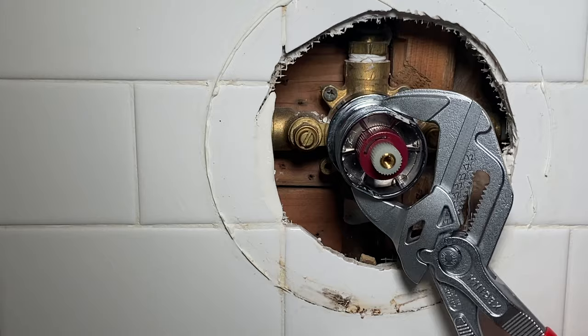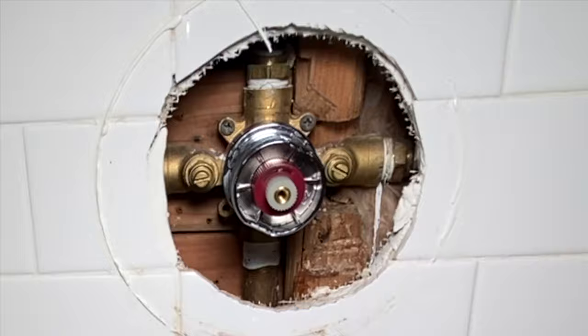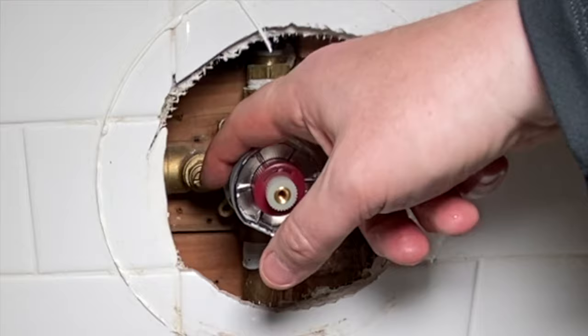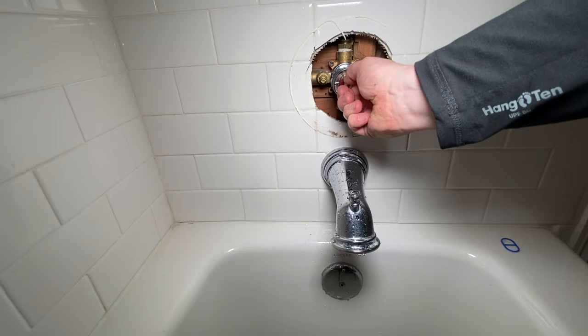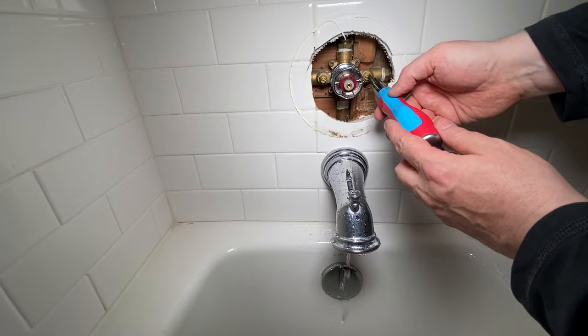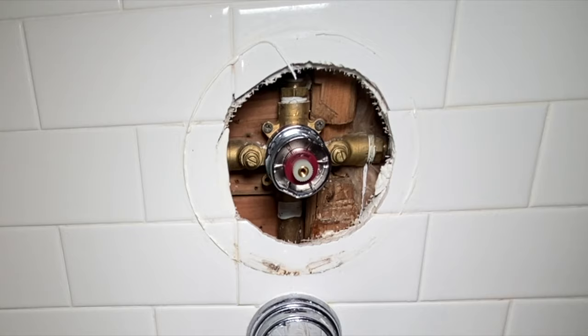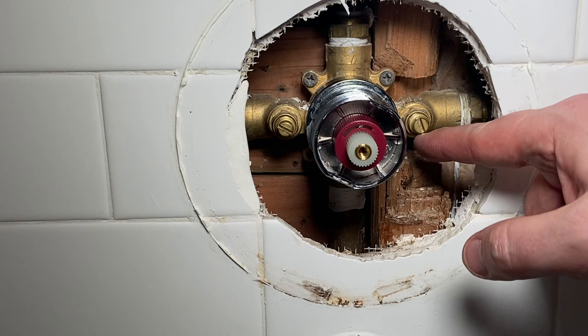Take your escutcheon, screw that back on. Get this tightened back up. Thread your handle back on — it makes it so much easier to open the valve since grabbing those splines bare is really hard. Now, if I had this one open, no water was going to come out until I opened the other one — that's part of the pressure balancing. If I shut this one down I get almost nothing, because it's pressure balancing. It's all the way to hot, but the second I open up the cold side, now we get full water. That is part of the pressure balancing on this valve — nothing underneath here is leaking.